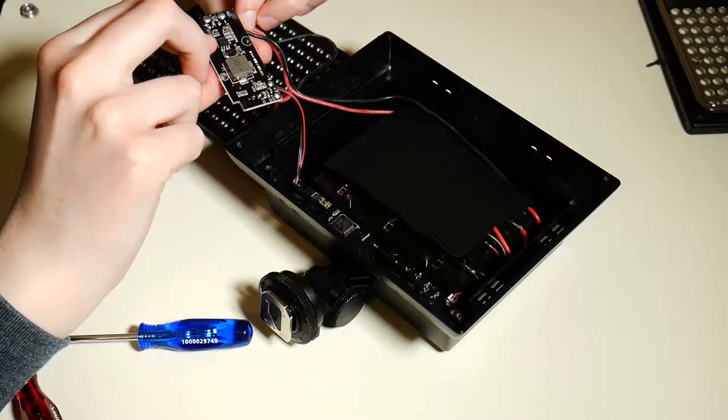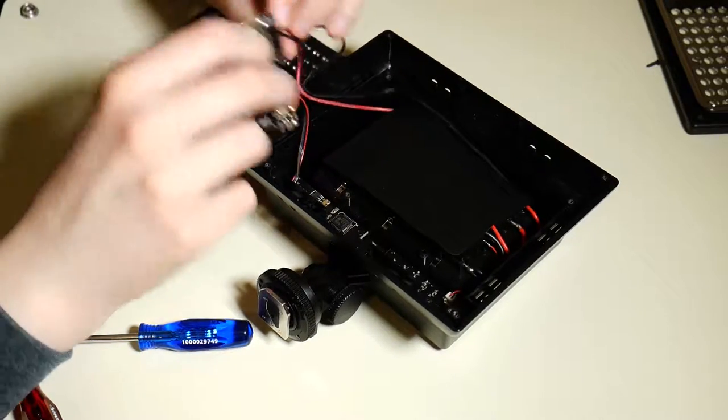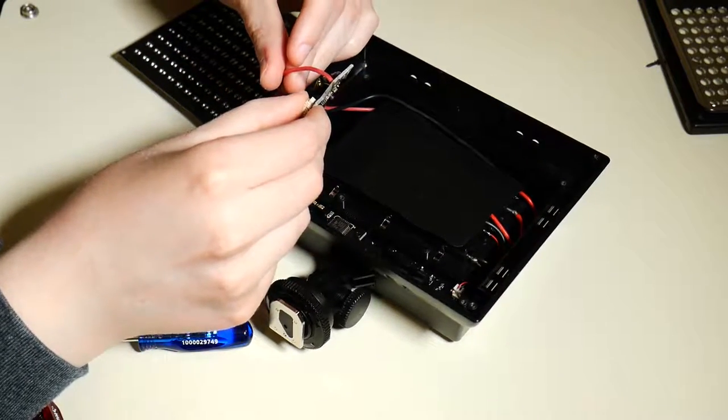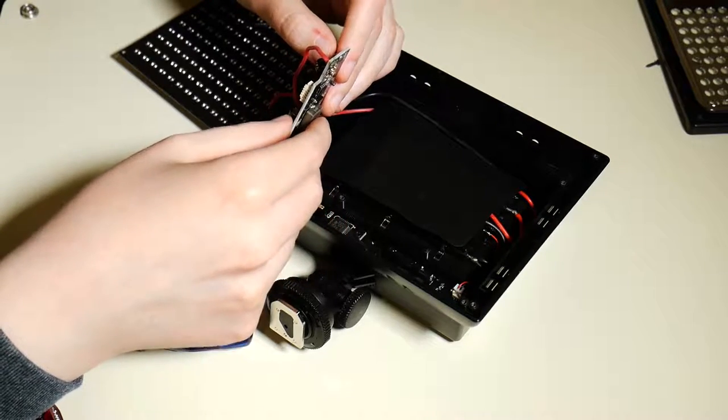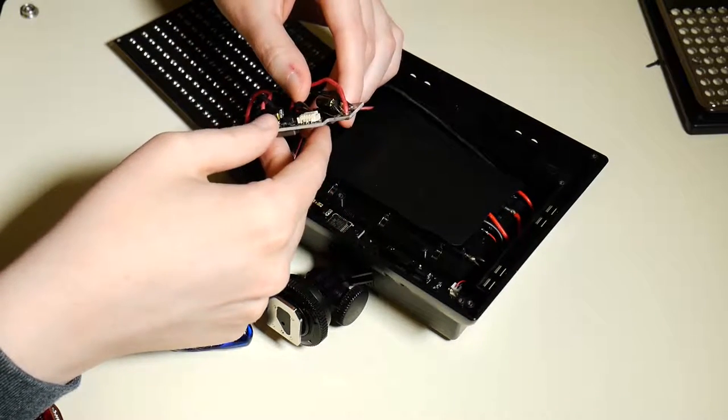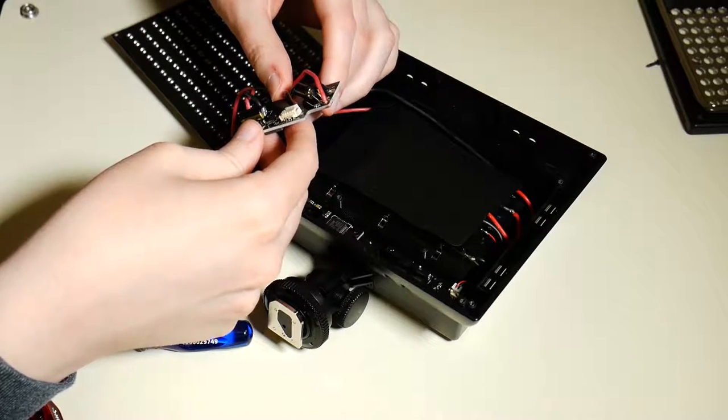Now, when I saw that, that meant I didn't have to really worry about conditioning my power too much that I'd be providing through the wall, because there's a circuit already going in there. A lot of times if you look up battery replacement things online, they'll talk about adding in resistors and capacitors and stuff to regulate your voltage. Because this was such a simple mathematical conversion to 9 volts and there's already a circuit doing that, that made me feel a little bit better about putting in pure volts to see what was going to happen.